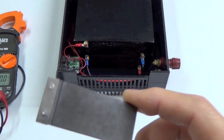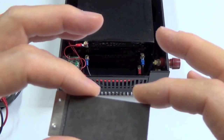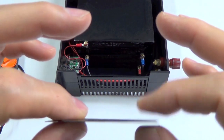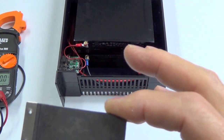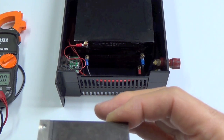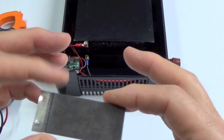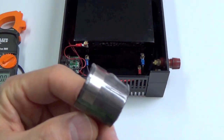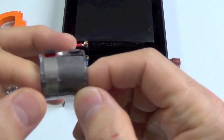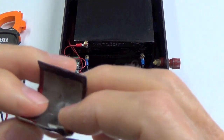I didn't mention the electrolyte. The electrolyte in between — the part that's so important — is a solid polymer electrolyte. It's got to be super, super thin to work, and it does. It's both an electrolyte and an insulator — it allows ion transfer. It's my own proprietary mix, but it has a curing time. When I first made the very first cell — which this is the one, the actual very first graphite polymer cell I made — it's wrapped in clear tape just to hold these contacts in place on the graphite polymer side and the graphite alloy side. You can see where I've marked negative and positive.